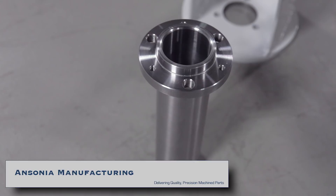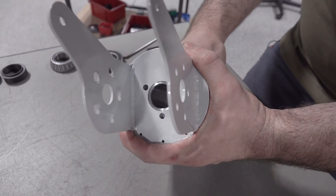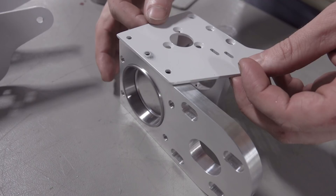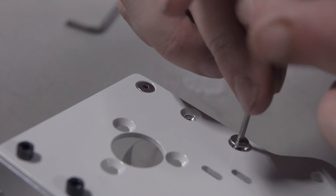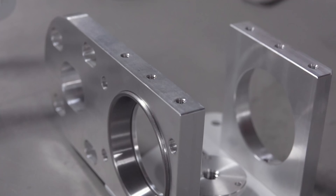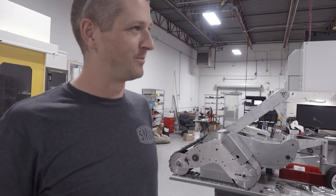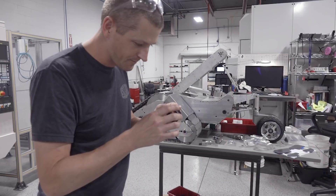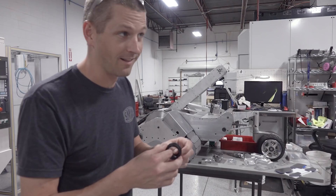Now assembling all of the parts that we built up to this point for Johnny Five's mid-torso, starting with the shaft made by one of our first collaborators — Andrew at Ansonia Manufacturing, one of the guys that John met on the NTMA tour in Europe. Parts are powder-coated, some are printed, and there's even a tiny belt. It's always a good idea on assemblies like this to leave the fasteners loose until the last possible moment, just so things can go together freely.